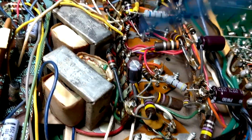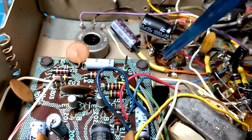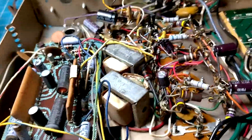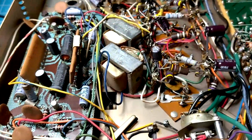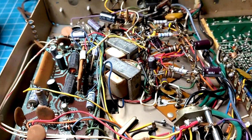And so anyway, these are the capacitors I put in here, here, and here, and here, and then the main power ones that replace this old electrolytic can. It's this one and this one. And it was a job changing some of these. The resistors going to them were messed up, but we got it working. So that's some good news for the owner, and now it's just a matter of recapping it. So I'll finish recapping it, and then we'll do a final video. Thanks for watching.